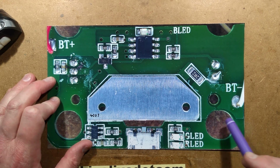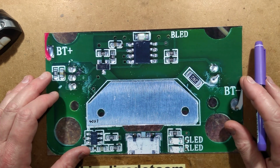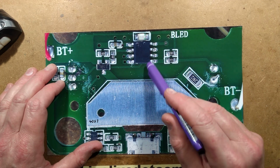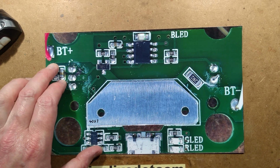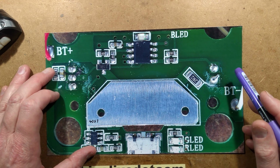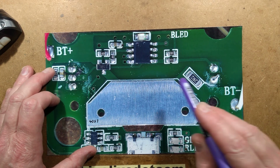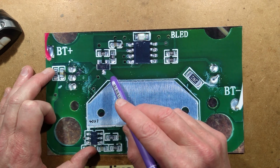Going over to the spicy bit, it's a classic unmarked microcontroller, possibly a Padauk, just the standard pinout, positive, negative, and then 6 general purpose I/O pins. Let's start with the straightforward stuff. So this pin here is going over to this transistor, which is just marked 23BL.